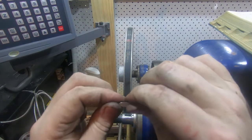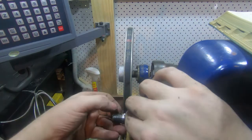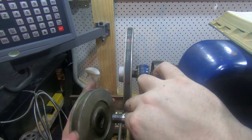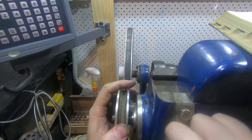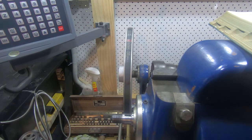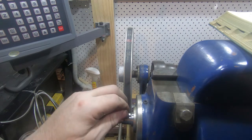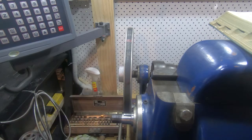I've got a little key — it's not very big, very easy to drop and not so easy to find. I've just filed that out of the piece of round stock, and with any sort of patience at all we should be able to fit that. It should slide on there nicely, I hope.